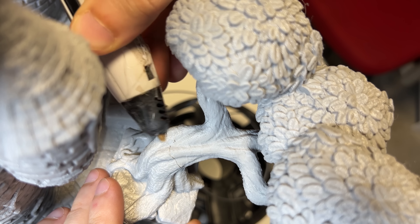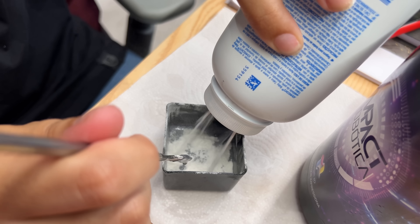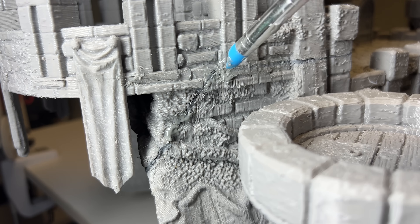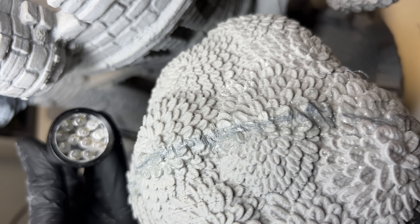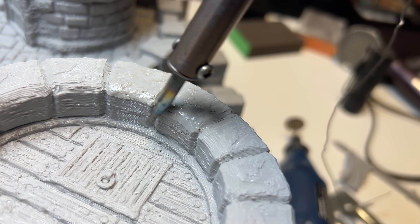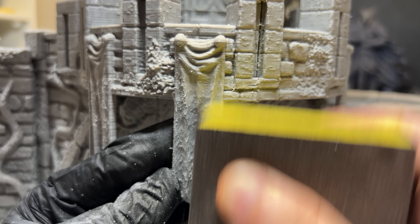The real friends are the tools we buy along the way. Another great trick is mixing up resin with baby powder — you can regulate the viscosity with the amount of powder added, and it makes for a great gap filler as well. After doing the seams with a soldering iron, a good sanding with an abrasive sponge does wonders on those organic shapes to wrap up the finishing process.